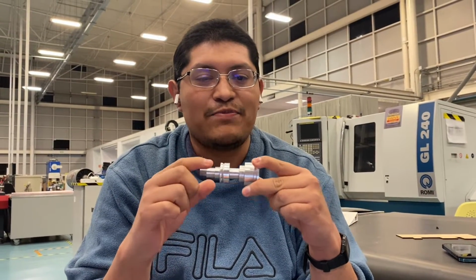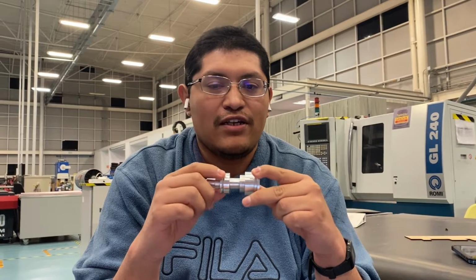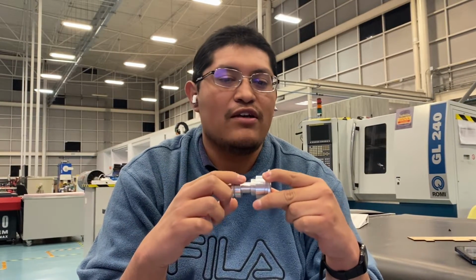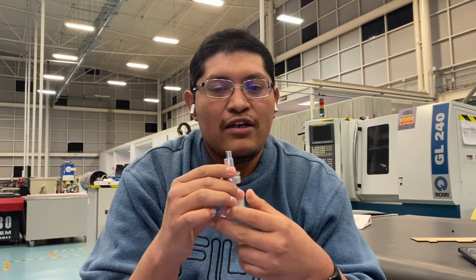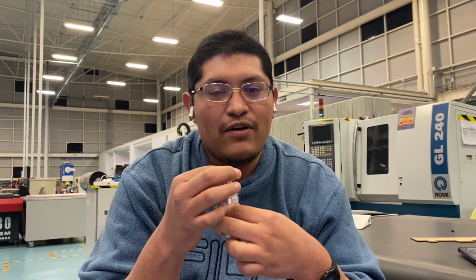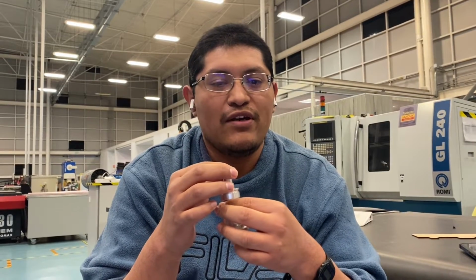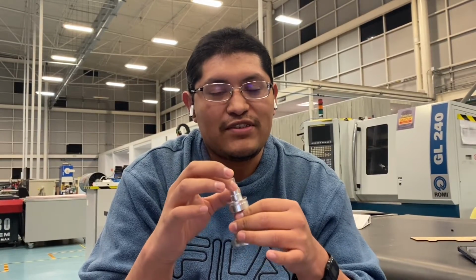This is the last piece. It was manufactured using mostly turning, with tools for facing, roughing, grooving, finishing and cut-off. The milling part used only one setup, where the Poka-yoke was made to be assembled with the fourth piece.